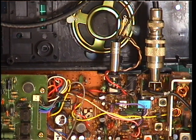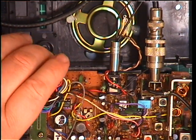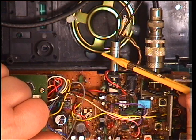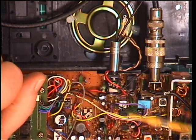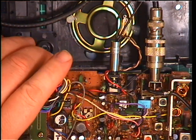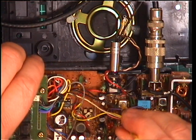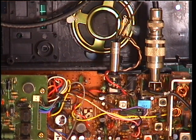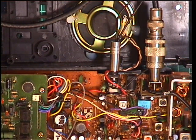Let's start with the detector. I put an S9 signal on the test — the signal generator — which is 100 microvolts into the external aerial socket. We've got the monitor loudspeaker, the Motorola signal meter, and an oscilloscope plugged into the output there. What we're going to do is look for maximum recovered audio from the detector coil, T4. This is a working set and that is perfect.